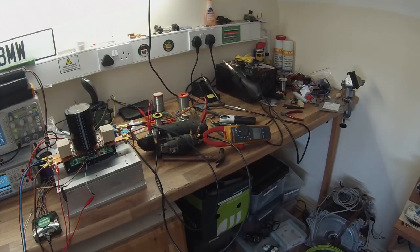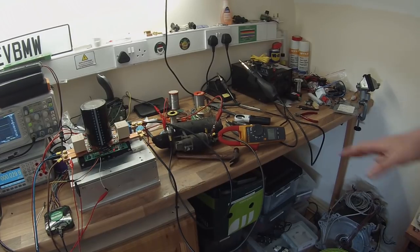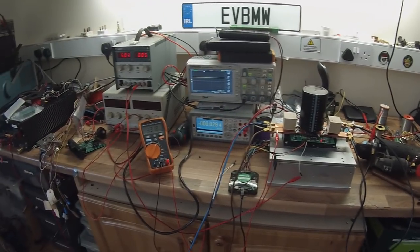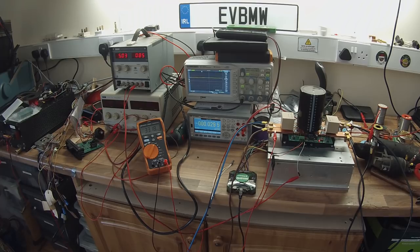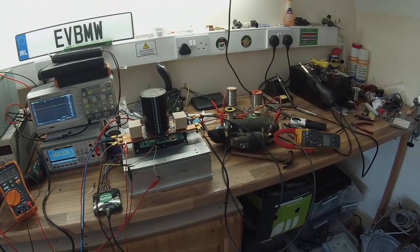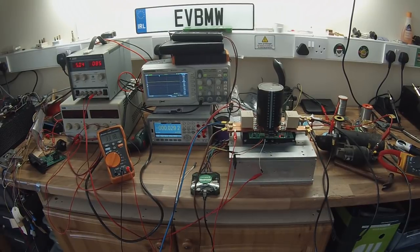I mentioned yesterday that this is a buck converter, but what does that actually mean in practical terms? We're used to thinking of a starter motor as a 12 or a 24 volt device, right? But we can control the power that's being delivered to a motor via the power stage. So we have a battery down there that's putting 33 volts onto the DC bus. And when we run the PWM, it'll take about 4 amps at 33 volts. And we're going to convert that through our buck converter into a much higher current, but a much lower voltage. So let's turn on the PWM once again.